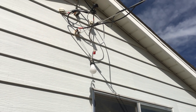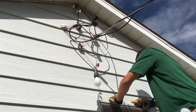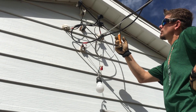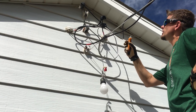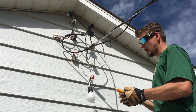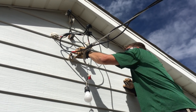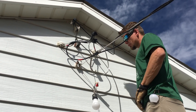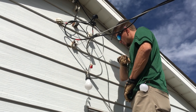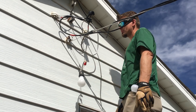This is energized right now — you could just use a simple wiggy. This kind of gives you an idea since I can't get into those bugs because I don't want to unwrap them all. It was showing me that this was the one I left on and this was the one that I cut. Now I've got that one back on. Out of all those legs, I was able to isolate which one. Now be careful while you're trying to figure that out if you're doing this hot, because if you get your elbow on here and touch here, that is energized.